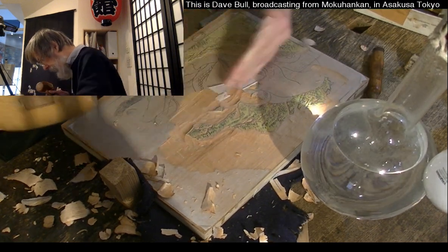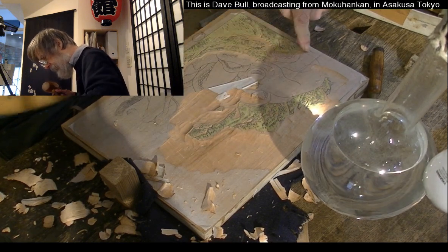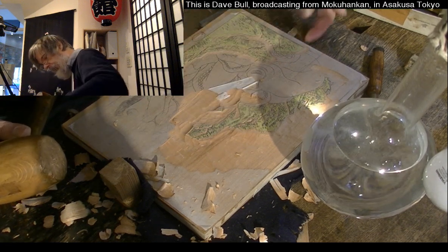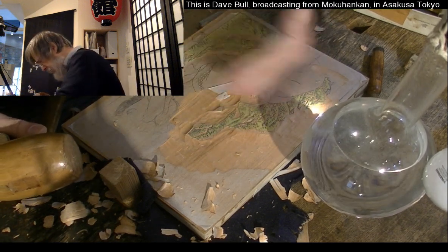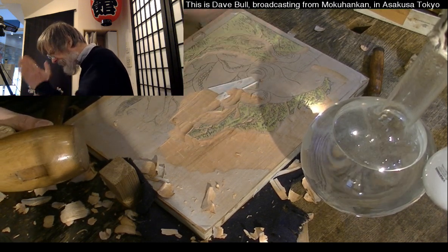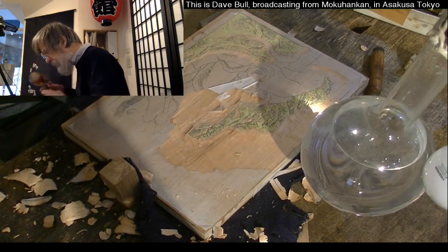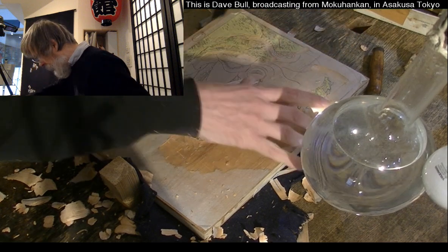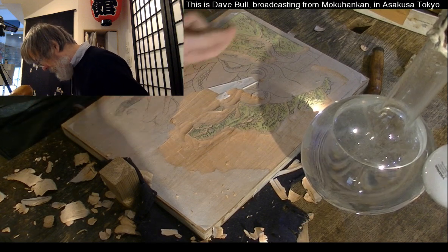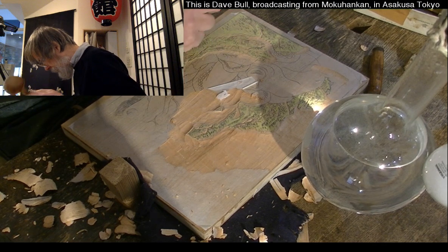We might find getting to this point that the wood grain is different. This is a plank, and it's basically from the center of a tree. The wood grain pattern has gone like this. So somewhere, if we had a three-dimensional cross-section, it would be perhaps pretty much on the center line of the tree. And then when you cut a plank, it's not always exactly vertical with what the tree was. Trees don't grow geometrically straight. Point being, sometimes you'll find the wood grain goes this way on this half of a block, and we'll see in a few minutes, the wood grain may go the other way on the other half of the block, depending on how the angle of the piece of wood was on the actual physical tree. We'll see in a minute.